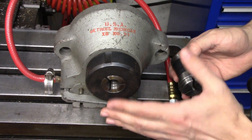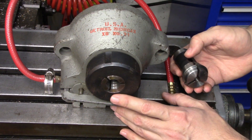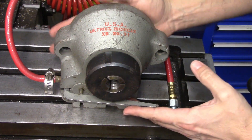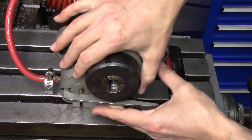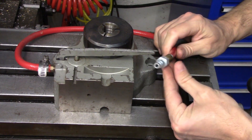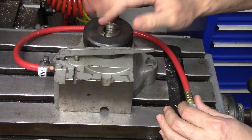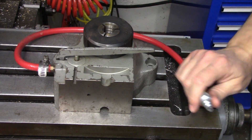The taper is actually pushed forward and it closes the collet but also maintains its length. That's important in production work because you always want to make sure that your material is not moving. The way this works, it can be put in the horizontal position where the part is horizontal, or it can be bolted down to the table. When air is supplied to it, this is always on, and you push this down to release the collet.